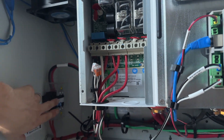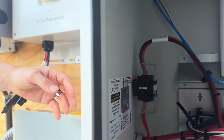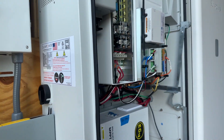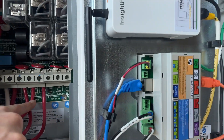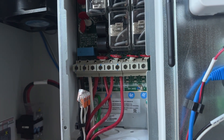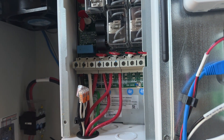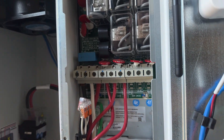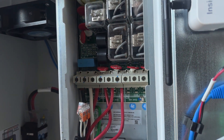When we first got this, this switch over here — and you can actually see it on the outside of the cabinet — this on-off switch actually runs to the AC1 port of the inverter, because that's the port they were using for power when this was connected as a SunPower system going over to a Hub Plus. But we're going to move those wires. You can see we already did that over here into the load output, because we're running off-grid.